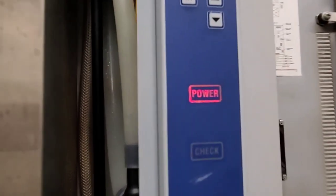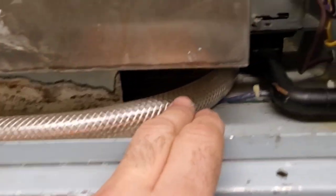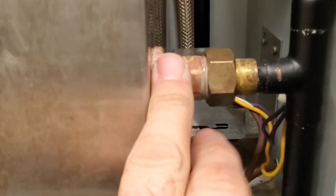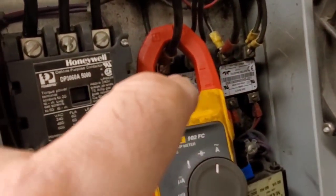Power is on, alarm reset, and we're filling up — water is entering right here through this tube, up through this contraption, and filling through the same line it drains from. We've got this set to 80% RH, as high as we can go, just to test it out. Once we know it's running fine, we'll set it back down to the set point they'd like it at.